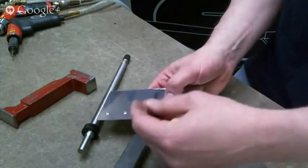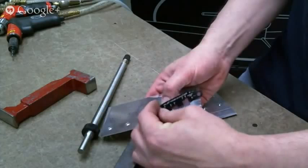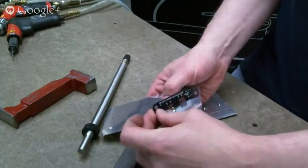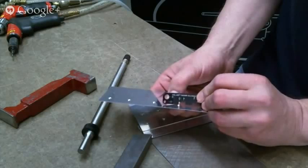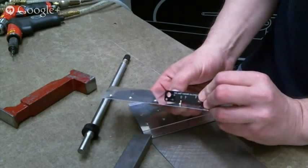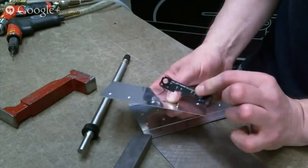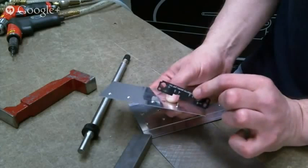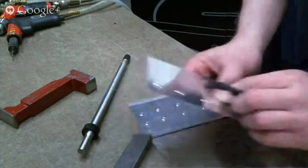And what these notches in the middle do is there's a mark 3, 4, 5, and 6. I don't know if you can see that, but I go from the bottom of the dimple to the end of the rivet, and I can see that that's the right length of rivet that's going to give me the right result. Now, this gauge is based on the ideal measurements. So this is 1.5 times the diameter sticking up to make that.